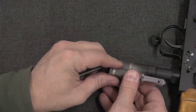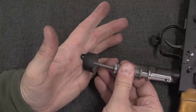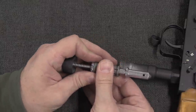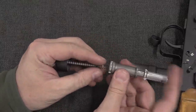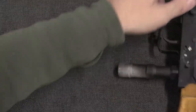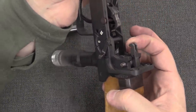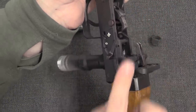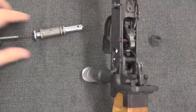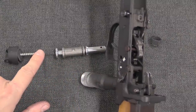This is sitting inside the tube in the grip. It's going to go downward, working against this spring until it bottoms out. It's then going to come back upward, and we have a loose weight on it here. This thing is going to slam back into the bottom leg of this lever, which is going to kick it up, which releases the bolt and allows it to go forward. So the amount of rate reduction is based on the weight of this plunger and the spring.